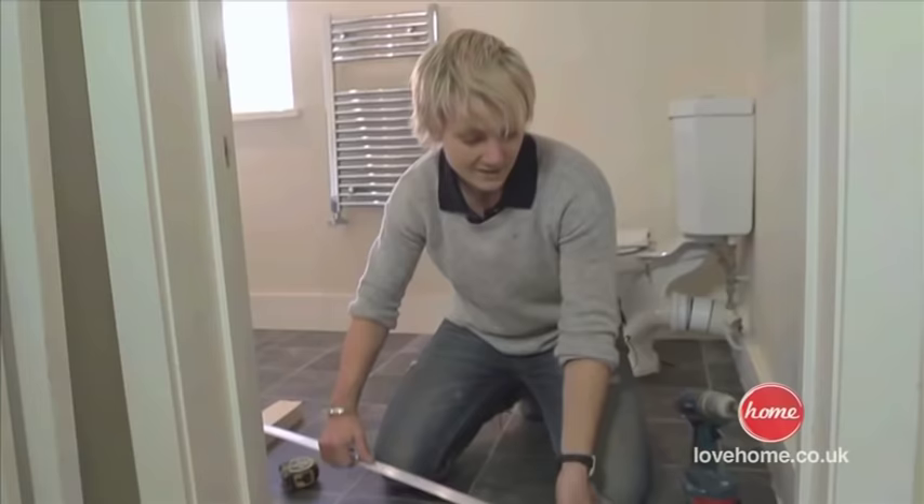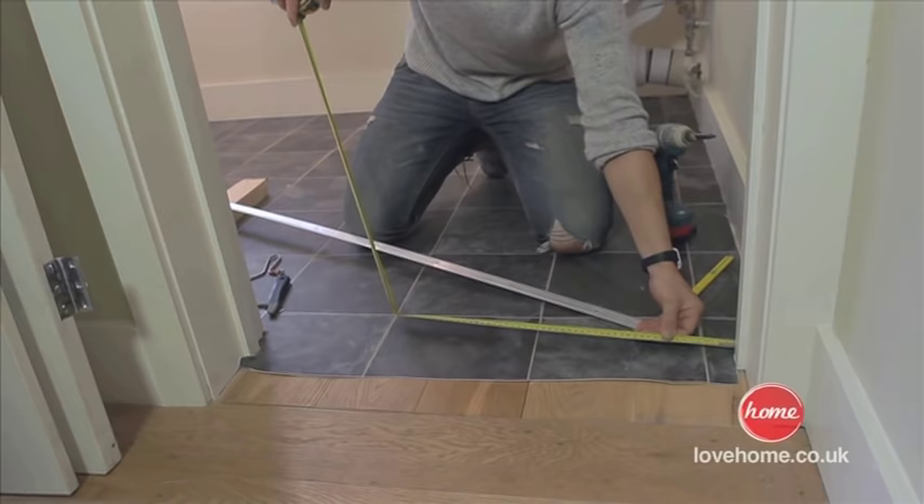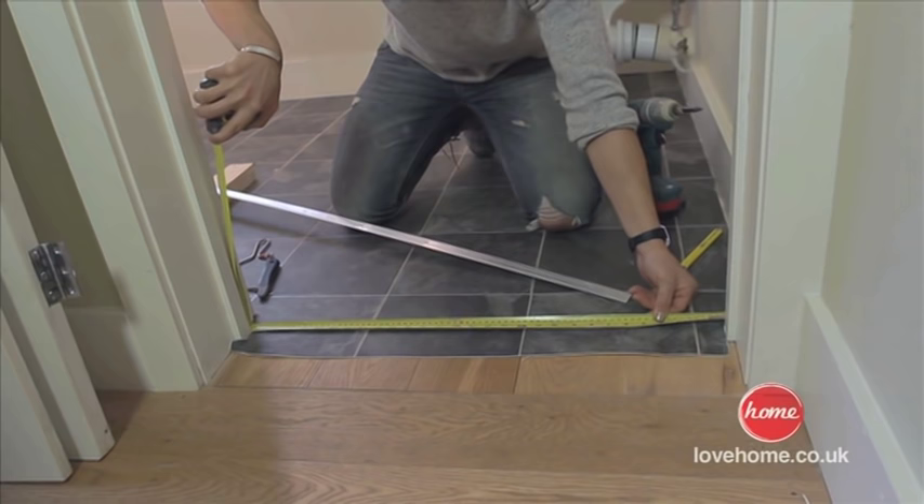The edging strip is the section that just caps off our vinyl flooring and gives us a nice edge to meet our flooring outside. We go just inside of the doorstop to just inside of the other side — and I read that as 30 inches or 760mm.